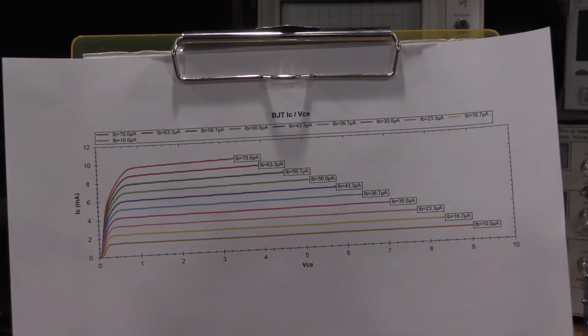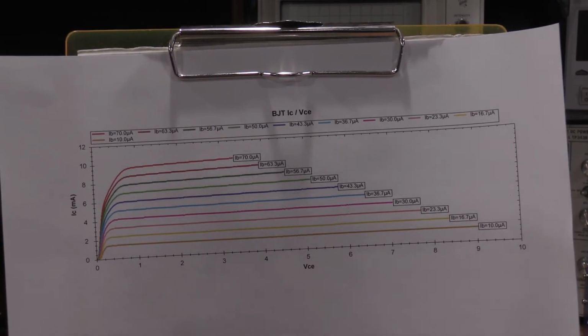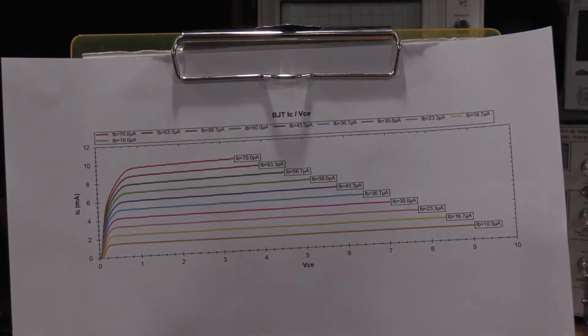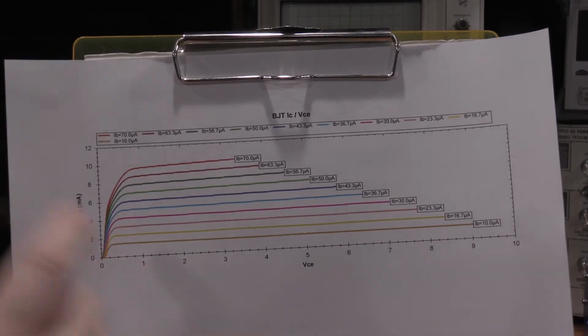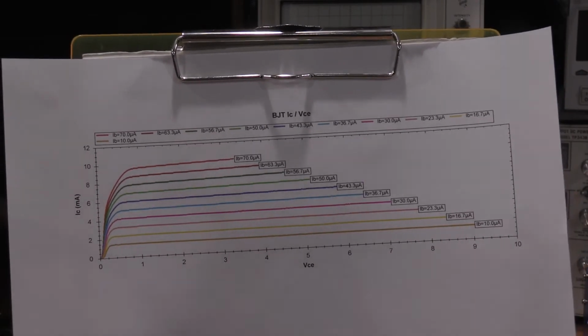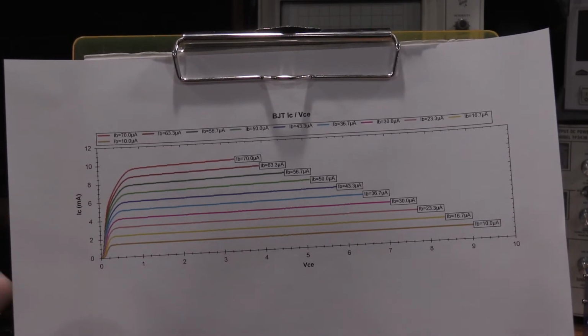So it'll allow me to test transistors even if I can't even find the device, because I have a sample and record of the curves from that actual device. And this will work with anything small signal. Won't work with anything much higher than 12 volts, at least that I've seen so far. But yeah, it's good to be able to compare transistors to each other without actually having any of the transistors.